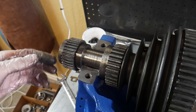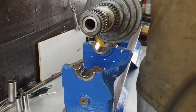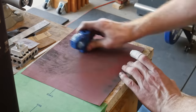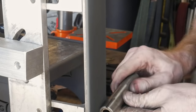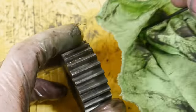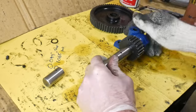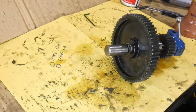I got the whole gear assembly back in the headstock. I'll be using a 4L-310 belt that you need to put on at this point in the reassembly process — otherwise you will not be able to get that belt on later. I found it necessary to clean up machine surfaces on many castings after painting, since here and there a little paint got through and I didn't want any paint between surfaces being bolted together. I used a screwdriver with a cloth wrapped around it to clean out each individual valley on the gears — some of that old grease is pretty hard to get off and you need something firm to get between those gears.